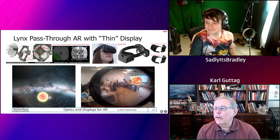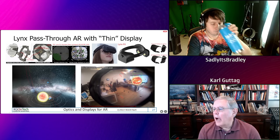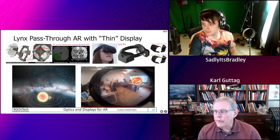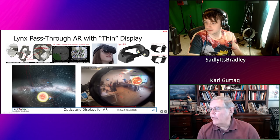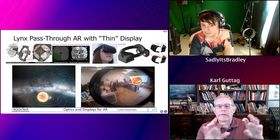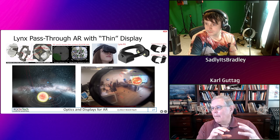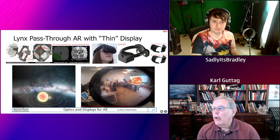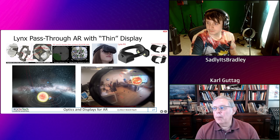A couple of problems: you can see almost right off the bat that you have to waste a lot of your display replicating the image. You can actually see these seams — they're out of focus. When you look in there, you can actually feel it even in Lynx mixed reality video. I freeze-framed it, and as he's moving around, you see a flickering pattern. What that is is aliasing — the beating of the camera pixels against what it's seeing as it moves. You get variable resolution depending on whether you're right on these seams where things are blending, so things are blurry and it's never perfect. Plus you give up a ton of resolution.